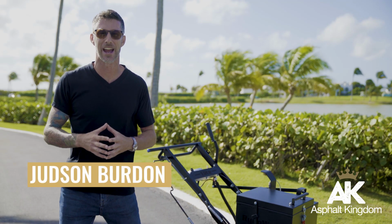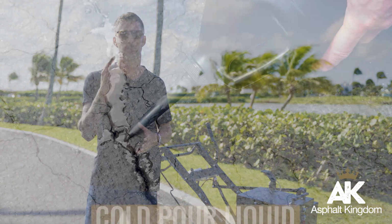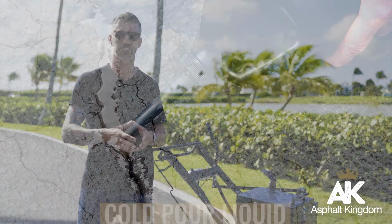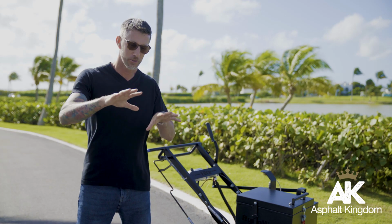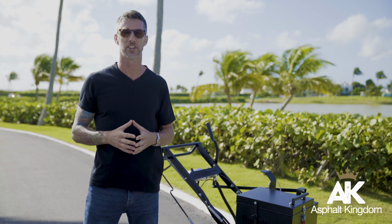How do you choose the right crack filler? There are 3 different crack fillers in the marketplace. Liquid pour crack filler, it's water-based. Comes in 1-gallon bottles, you squeeze it in the cracks, the liquid crack filler settles, gravity allows it to spread out. Takes about 2 to 3 hours to dry up, creating a watertight seal.